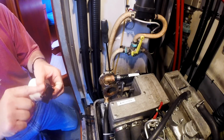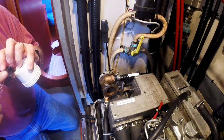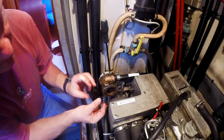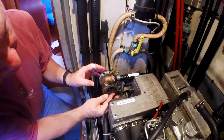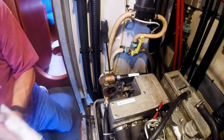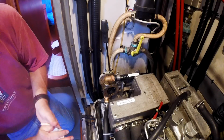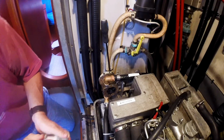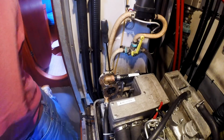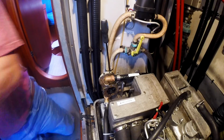They fit, obviously, but it's not really working. So let's try this. See how we do. Already it doesn't want to go in. That's a good sign. You don't have to worry which way the vanes go, because when the pump turns, it'll flip them around the right way. So there's really no concerns there. I am going to use some rubbing alcohol to clean up the gasket surface.